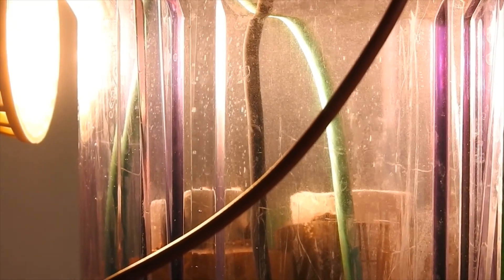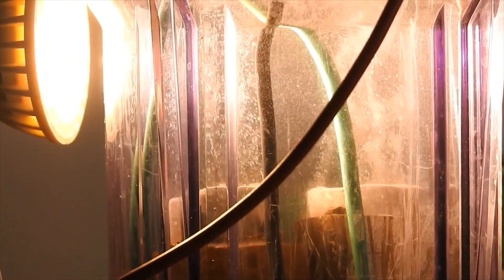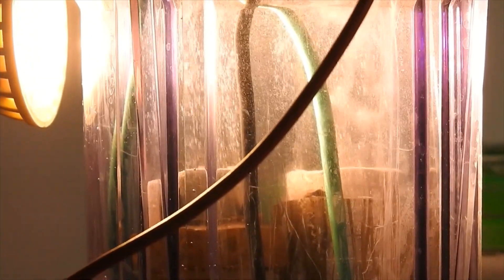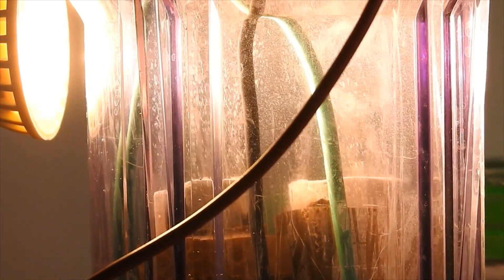Bear with me a second here — takes a second to get going. That's pretty good production for one milliamp. It's barely turned on, not as low as the setting will go. So the PWM consumes 0.02 and it's at 0.03 right now.